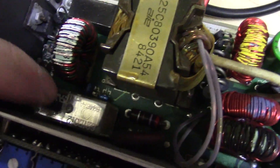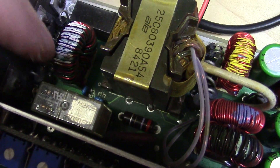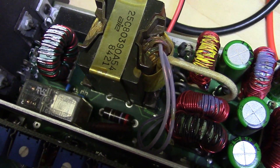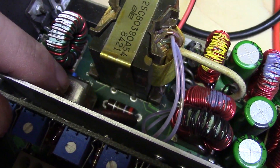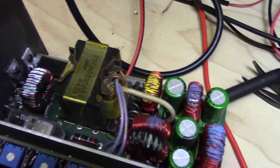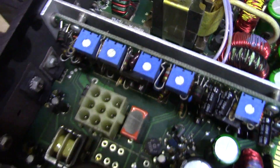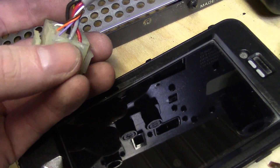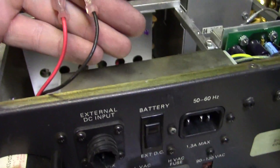There is one other relay up here that I'll be removing. It's actually drawing a lot more current than this one and it's not actuating — it'll go up to about 3 amps, which more than likely is what's causing the fuse to blow. I'm going to pull this one out as well and see if I can find some replacements, and continue testing the rest of the supply. It's actually fairly easy to power — there's a center pin which is ground, and the red wire goes right up to where the battery connector is, so it's fairly easy to test.